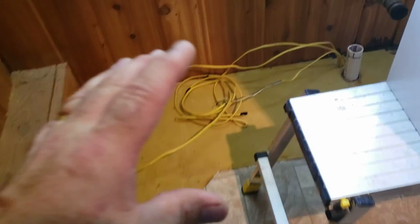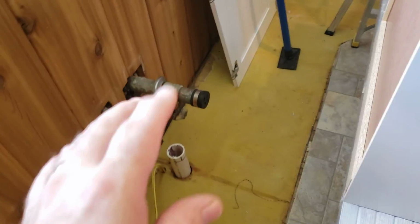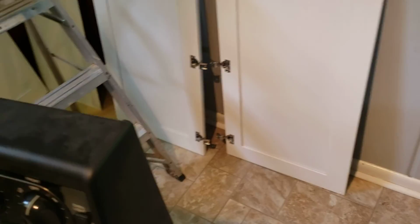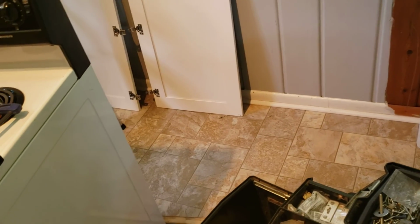That will allow the customer to have a toe kick area underneath the sink area here that would normally be there. And then on the other side, we're going to do the same thing. There's actually a toe kick area there. I'm going to carry that toe kick area across and do an OG pilaster molding and return under there. So all in all, it's going to be 4 pieces of OG pilaster molding.